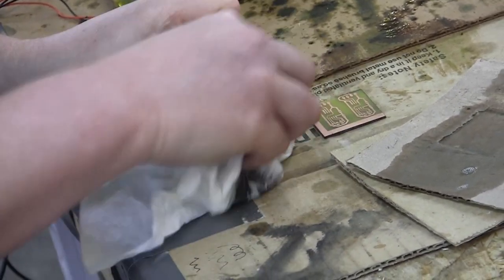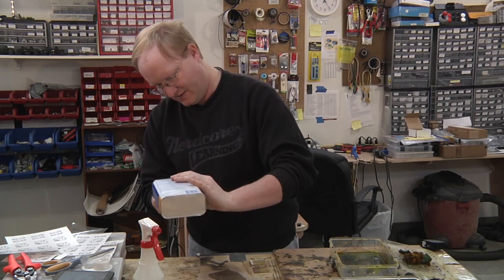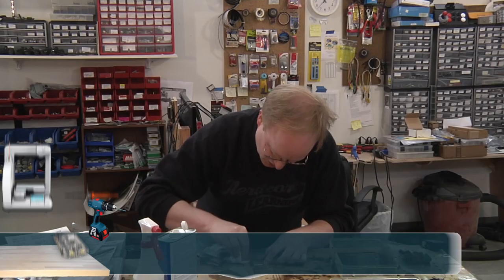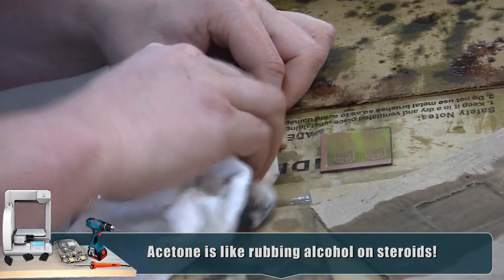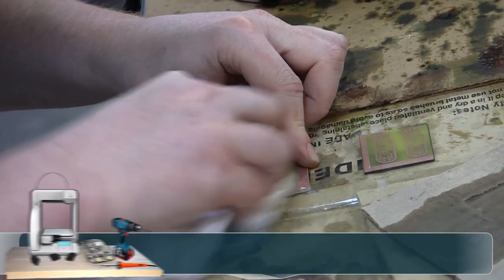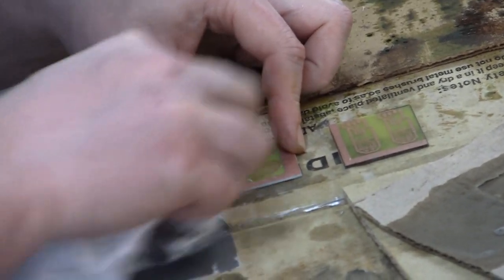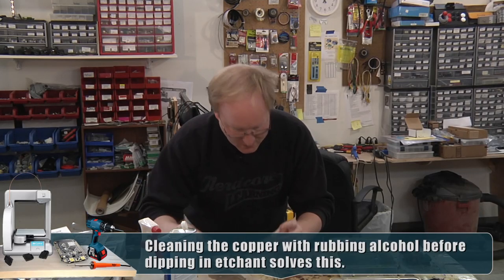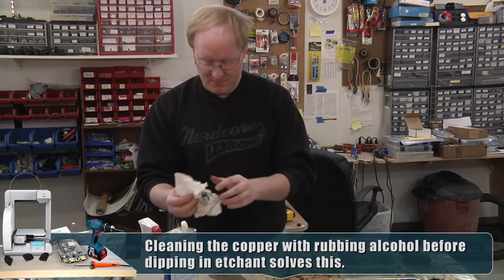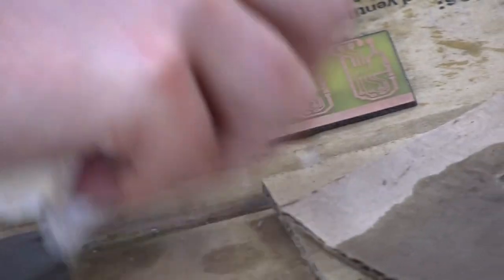We also tried a different type of paint. It's more resistant to acetone, but nothing can stop acetone. What we noticed was the spray paint method gives a really good edge, but the laser doesn't actually remove all of the paint even though it looks like it's all gone. There seem to be very small trace amounts or burnt paint residue left on the copper, so it takes a little bit more effort to get that copper to etch.